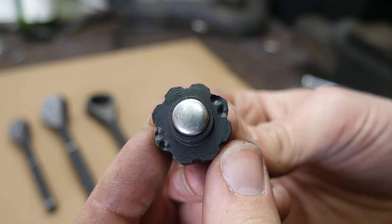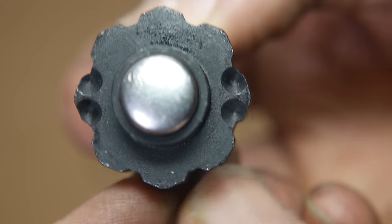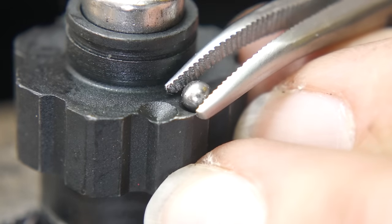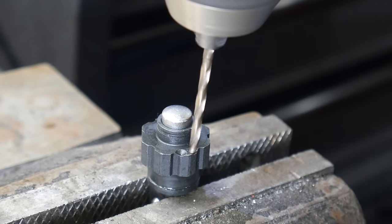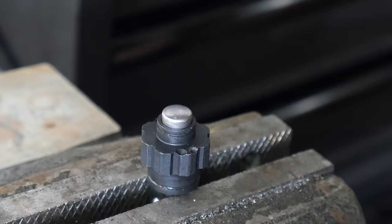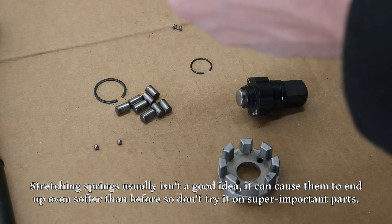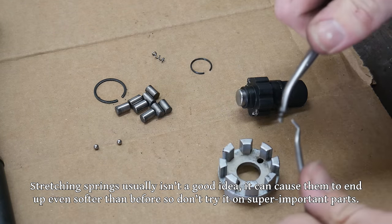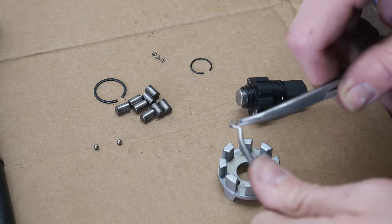We'll take another look at exactly how this works when we start putting it back together. But as far as our problem of the ratchet reversing direction, that seems to be a problem with the detents not being strong enough. These divots in the drive head are where the check balls sit to lock it into place. One way to make the detent stiffer would be for these seats to be deeper. We briefly gave it a try with a drill bit, but the drive head is surprisingly hard for how cheap this ratchet was, so that wasn't going to happen. The next thing we can try is to increase the spring tension. Sometimes you can get a little bit extra by stretching the springs, but these springs weren't really having any of that and would just revert to their shorter height as soon as they were compressed. I didn't have any other springs this diameter and wire thickness on hand, so we'll just have to try something else.